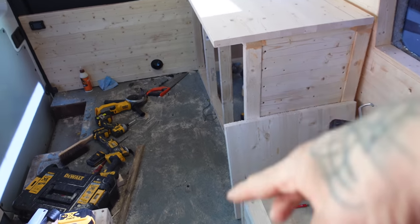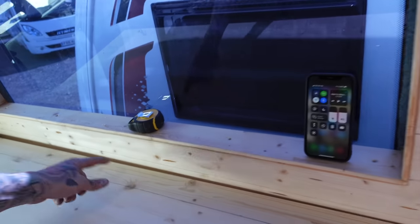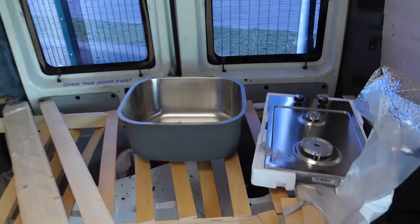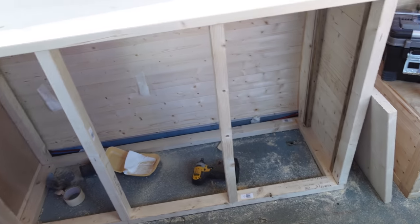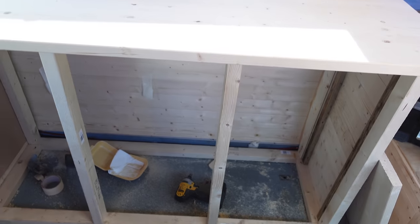I've just boxed in that part and now I've put the worktop on, just cutting the worktop to shape. I'm trying to get it to fit really up to this edge here. I'm trimming the back edge off around three inches and then I'm going to budge it up — maybe chop a bit more off that side so that it meets up to this bit here. The sink and the hob are here. The customer's just been here to let me know they want the cooker this side, then the sink this side, and then a gap in the middle for chopping stuff up. You can kind of see what the cupboard doors are going to look like. Gas and water bottle potentially that side, and then a shelf there, so there's four compartments for food and stuff.